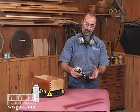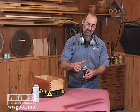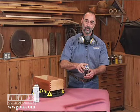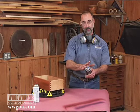Some aerosol cans, like this one for topcoats, have a nozzle on which you can actually control the fan either horizontally or vertically. That makes it a lot easier, especially if you want to spray up and down a project or across a project. You're going to get a better quality topcoat by looking for an aerosol can that provides the ability to control the fan pattern.